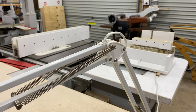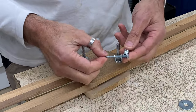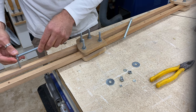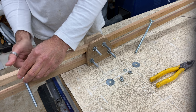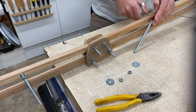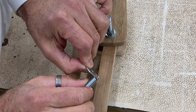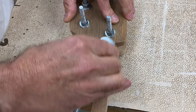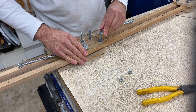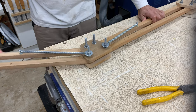The lamp mechanism had these springs attached to help counteract the force of gravity, so I thought I'd add the same to the camera boom. I used some quarter-inch screws through one end of the spring with a nut and washer placed up near the head, and then fixed those screws through the strut arms with another nut and washer. To attach the other end of the spring to the pivot bolts, I drilled a small hole in a mudguard washer and placed that over the end of the bolt. I then used another nut to keep them in place, left loose so the washer could rotate with the arm movement.